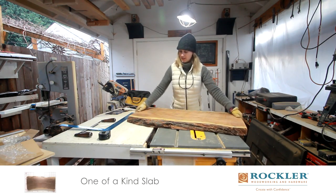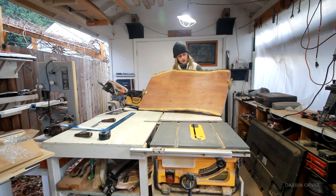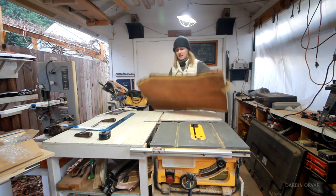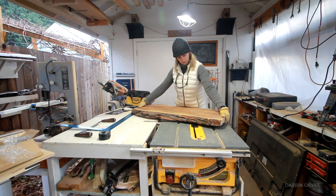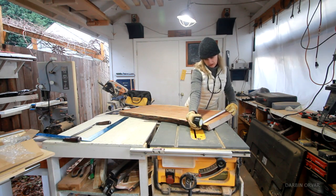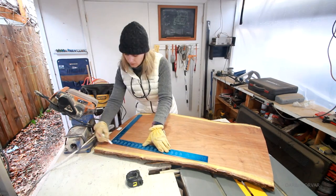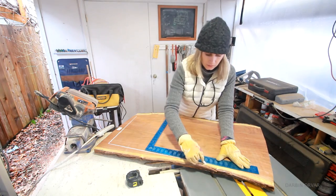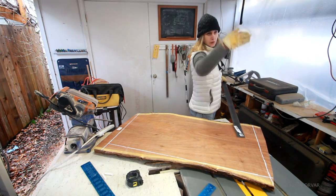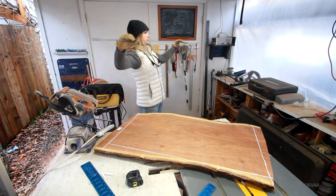This is the slab and I really like how the sapwood is so yellow, but then there's the red mesquite color to contrast that. At first I'm just looking over the piece — it is very flat, which is nice, so it doesn't need any jointing. I'm deciding which side should be up and down and seeing how much the size differs on either side. To get a better idea of where to cut the sides, I'm marking a line so the two sides will be parallel. Also this is the steel I picked up, just thinking about what this is going to look like and how I'm going to construct the base.